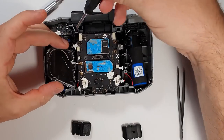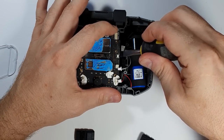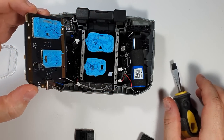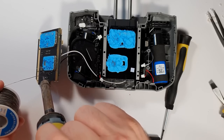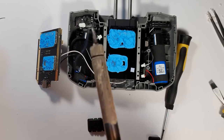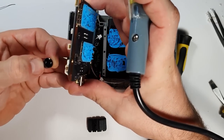This plastic lid houses the antenna cables. I removed it because I didn't want to disconnect the coaxial cables — those are two small connectors and I've had bad experience with them before. So I just flipped over the PCB to get access to the solder pads where the buzzer is soldered in. I put some leaded solder on it because it has better melting characteristics to remove components, and then the buzzer is completely removed.